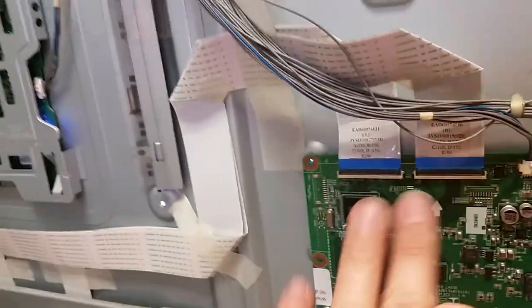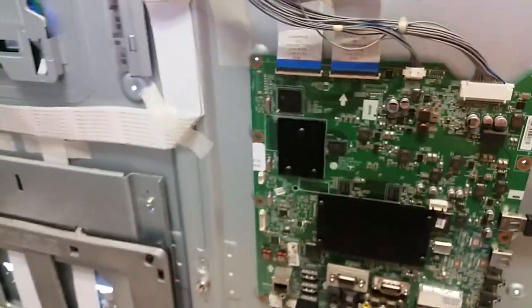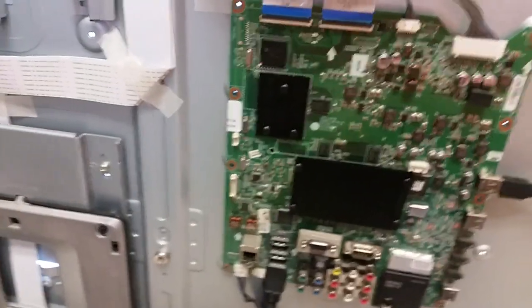Anyhow, this is what is connected to the TV. Don't pay attention to the lines. They just showed up the other day, and they show up on all of our boards. Either the cables are going wrong or the panel is starting to go wrong. It is not related to this board. We get the exact same effect with all the other working boards that we have here. It's either something in here, or more likely, in my opinion, the panel is just going bad, which is quite alright. We can still use it for testing.